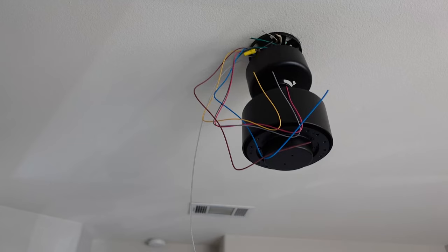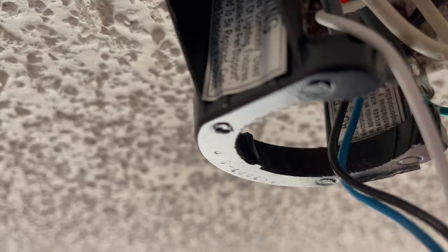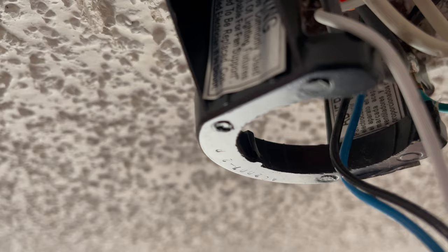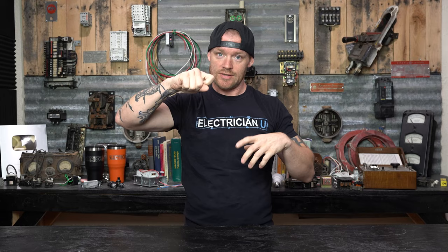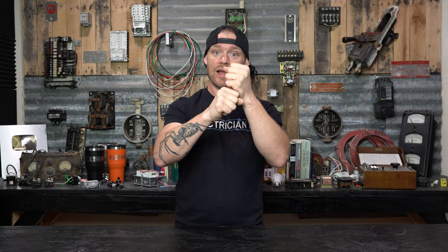Once I've got everything fully assembled, it's time to go hang everything on the bracket. I go up the ladder and hang this motor in place. Every ball that comes on a fan has a little notch on one side, and inside the actual bracket itself there is a tiny little bump. When you twist that ball, there's a certain place where that slot and that bump meet up and everything locks in place. You've got to make sure you do that — otherwise this fan might wobble. This is designed to be locked and kept in one place, and it drops in perfectly when you find that spot.